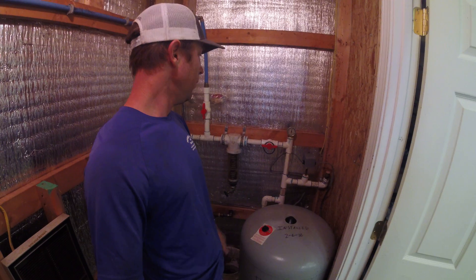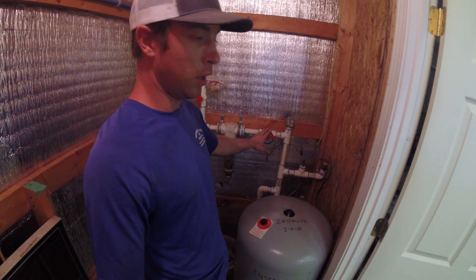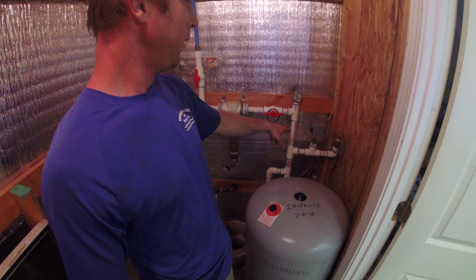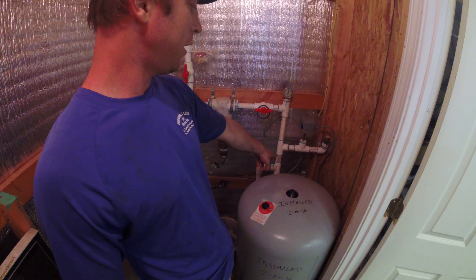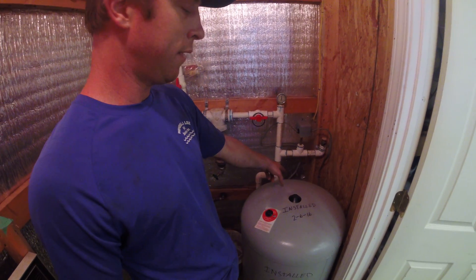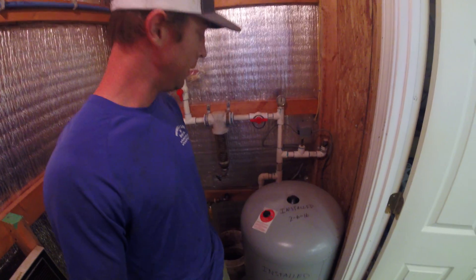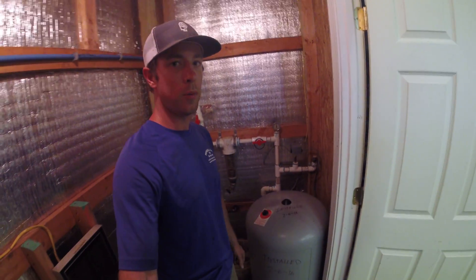Just keep this in mind: the number one rule for locating a shutoff valve on a well pump is that it has to be downstream of the pressure switch. There cannot be any valve or filter located between the pressure switch and the well — everything has to be downstream so the switch has a way to cut the pump off. Quick video, got some of my boredom out too. Hope y'all enjoyed it — thanks for watching, stay tuned for more videos.